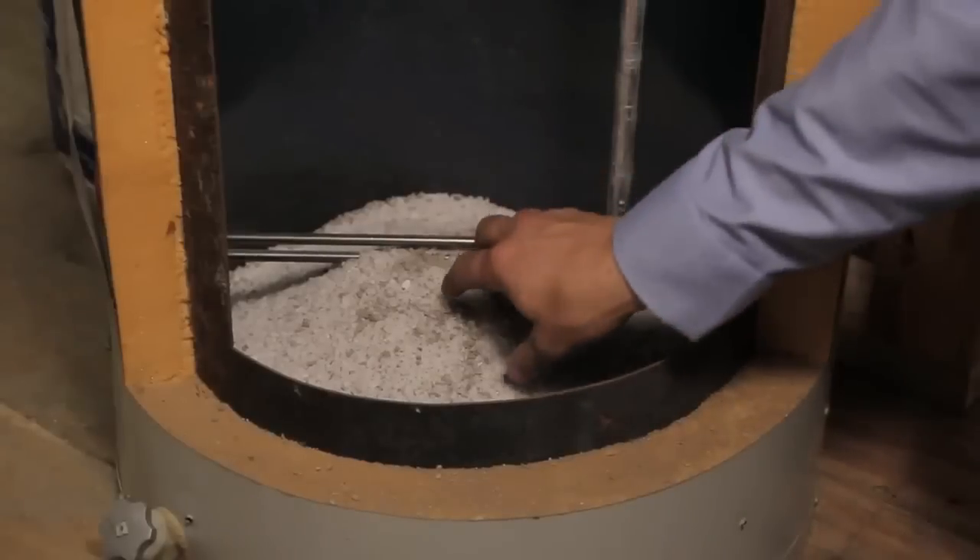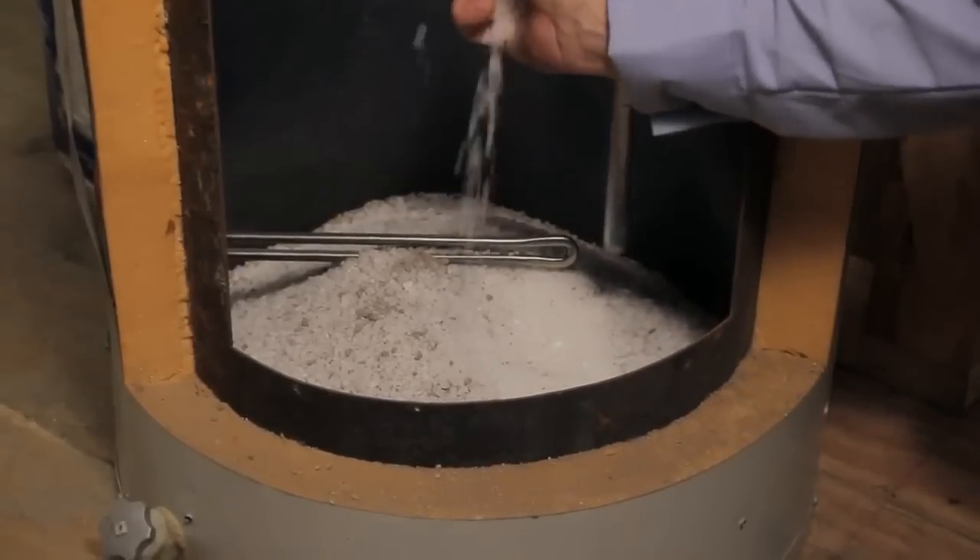You may have noticed that your water heater makes noises that sound like gravel popping around or popcorn popping inside of a pan. I'm Dave Jones, a master plumber for Roto-Rooter Plumbing and Drain Service. If you're hearing a lot of popping noises from inside your water heater, you have calcium and sediment buildup inside of the tank.